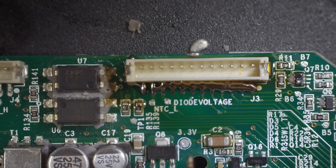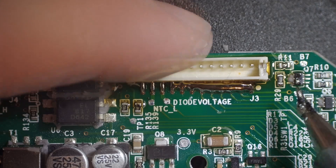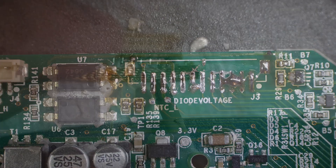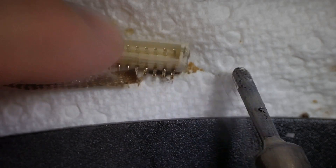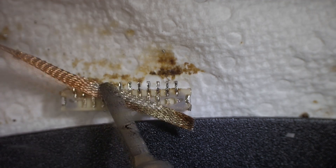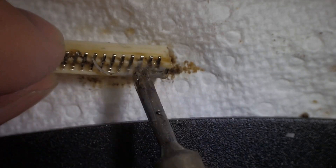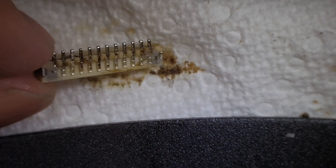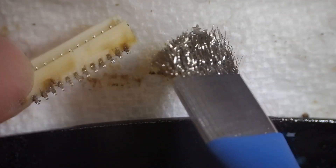I accidentally bumped the lens of the camera on the microscope — let me go up just a little. We should be ready to come off. Definitely have some silicone, but not nearly as much as the Gen 3 board did. I want to take time to clean the connector up well before we put it back on the Gen 3 board. A little bit of flux and braid is going to go a long way cleaning off the low melt solder left on the pins. There's some silicone we've got to get off. Now a little bit of high-percentage alcohol and the brush, and we're cleaning up pretty nicely here.